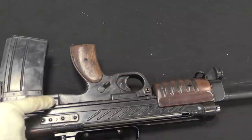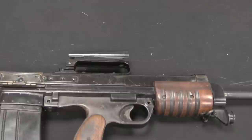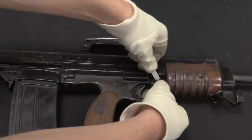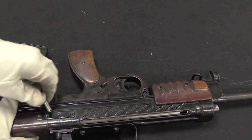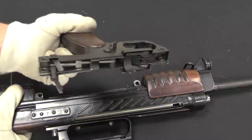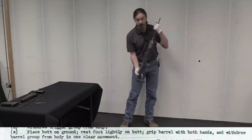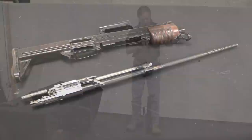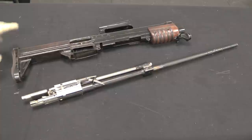Next up, we need to take the firing grip assembly off. This is retained by two split pins — let's push these out. Now the trigger group comes off. I swear to you, this is how you're supposed to do it according to the manual. At this point you place the butt of the gun on the ground, step on the butt plate, and pull the entire working bit out the top. We now have the receiver assembly with some of its various attachments separated from the actual barrel gas piston working bits.